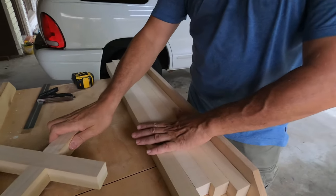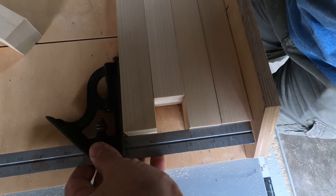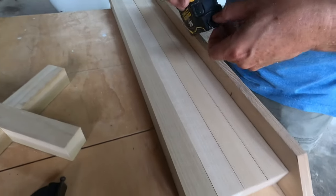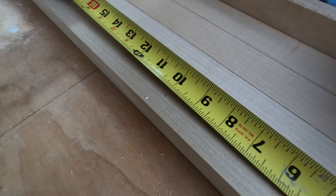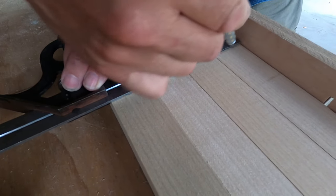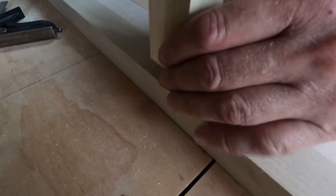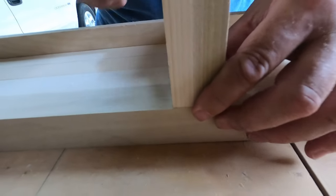So here's our 4 legs. I'm gonna square up the ends like this. Perfect, right? I'm gonna make a mark at 10 inches. And then transfer that mark across all 4 legs. Just like that. Now that line represents the top of the base where our plant will sit.